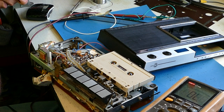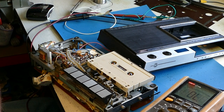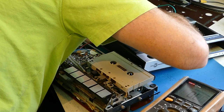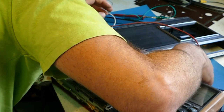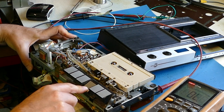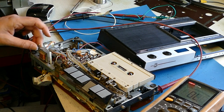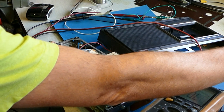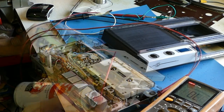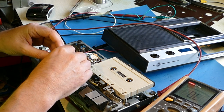Let's pick up the power supply again and see if it's now working reliably. Power it up — no overload — press play. Well, it's certainly working. Right, I'll power that down, I'll put some switch cleaner in the volume control and tone control. There's some switch cleaner in there. I'll also refit this meter. Okay, power it up.